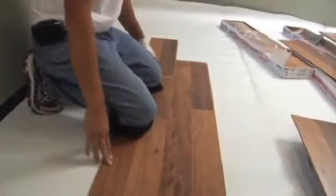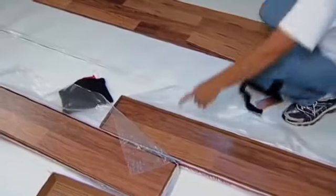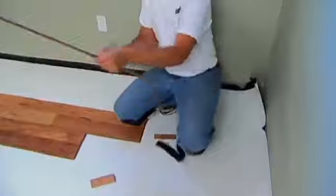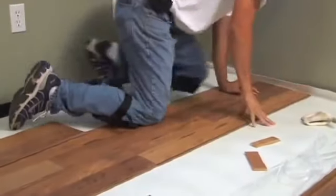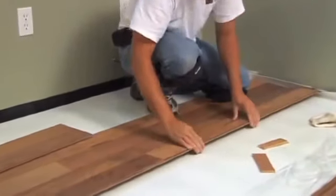As you assemble your floor, pull planks randomly from cartons to ensure the best look. Choose a shorter random length of at least 12 inches. Cut a full length if necessary at 1/3 or 2/3 to maintain random end seams of at least 12 to 16 inches apart. Angle up from the end of the entire row and push into the side seam.